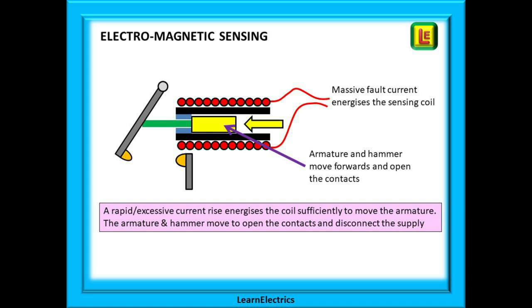When the circuit breaks the supply is disconnected. All MCBs will latch into the off position — the disconnected position — when they sense overloads or faults. They will not auto reset. We must physically reset them ourselves when we've cleared the fault.